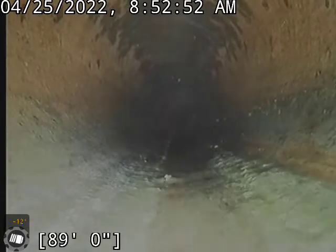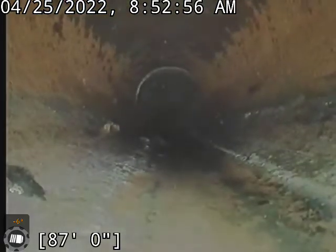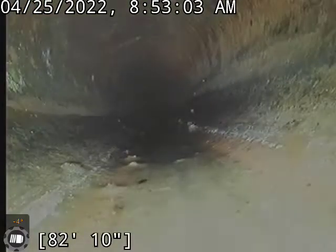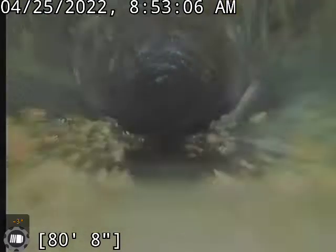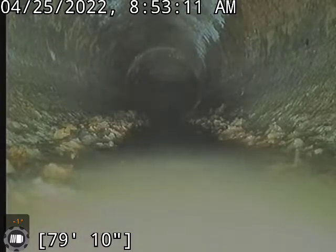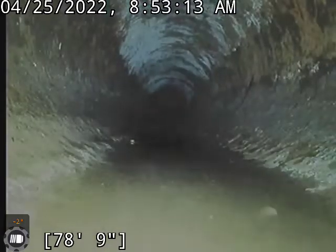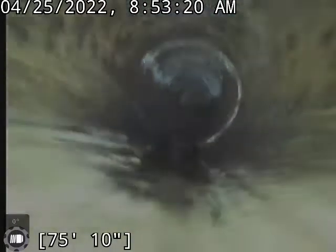This is a clay line. Got some scale right here, so I ran a lot of water trying to push the scale out, but as we pull back you'll see chunks like that. Got that root right there as well near the washer area.